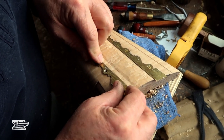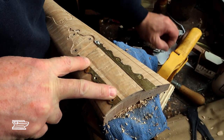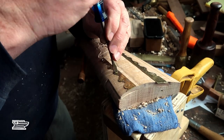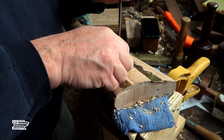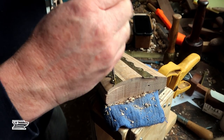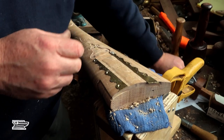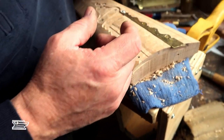I'm just going to stick this back on with a couple of screws. These screws I'm using right now are all sacrificial — just assembly screws is what I call them. The final screws will be nice — they won't be in and out a hundred times. It'll all be steel screws with fire-blued heads. Why not brass screws on a brass patch box? Because I like the look of steel screws — the original box had steel screws and I like that look on a brass box.